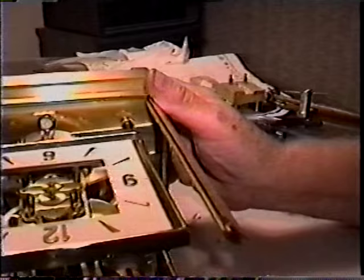So all the power is released from the mainspring. And we'll take our movement holder, put this aside a little bit. What we do with the movement holder is we set our movement on the stand. This way here, it protects that fork from being damaged in any way. And it's also a good movement holder for when you're assembling and disassembling the movement. I'll set that aside and we'll get back to that.